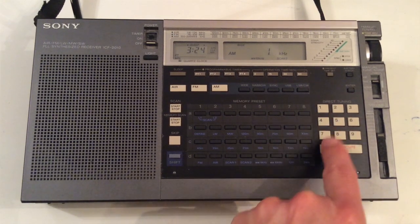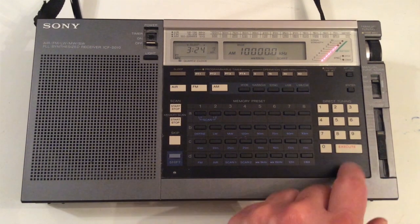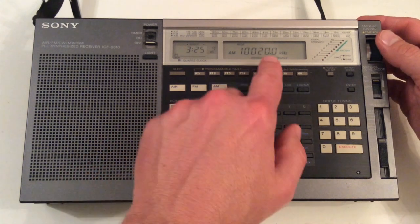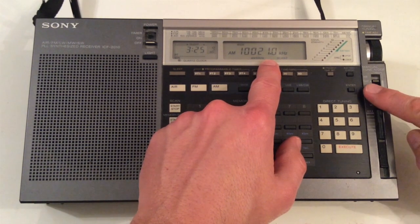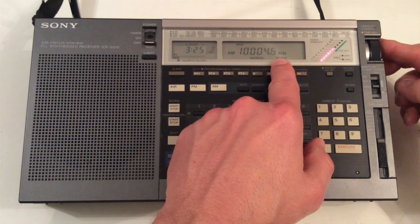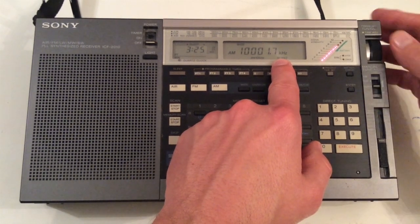This radio is very sensitive just using its built-in whip antenna and the internal amplifier. I generally find that on the ham bands or shortwave broadcast bands I can pick up just about anything I can hear on my main HF rig in the shack with the outdoor dipole — a little bit less signal strength, but usually I can hear the signals. Due to the phase lock loop circuitry — the PLL — it is very solid on frequency. I cannot tell any drift; it is rock solid. The sensitivity is very good, making it excellent for pulling out weak signals on any mode.